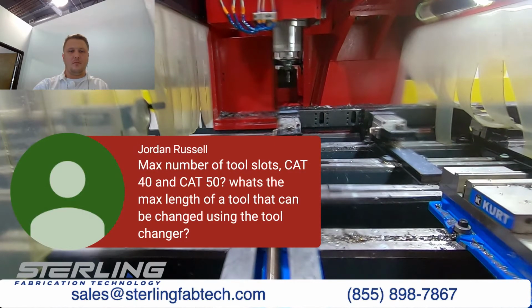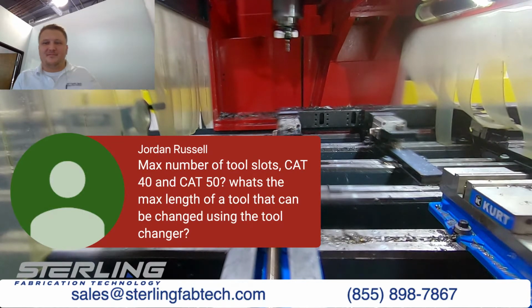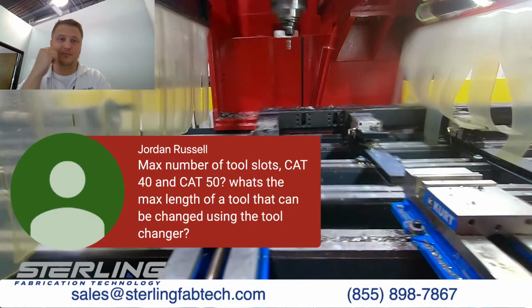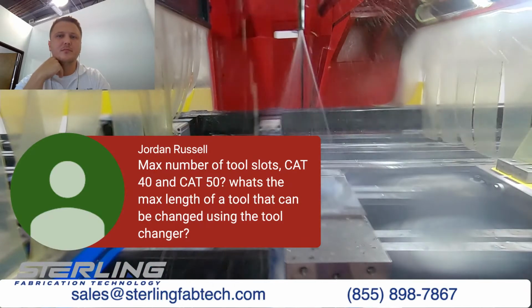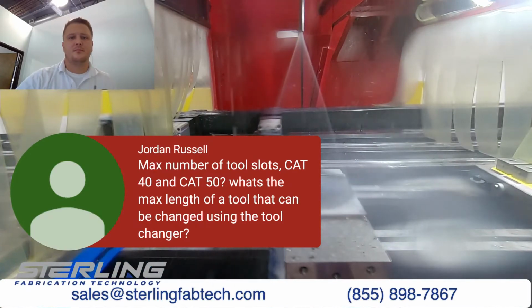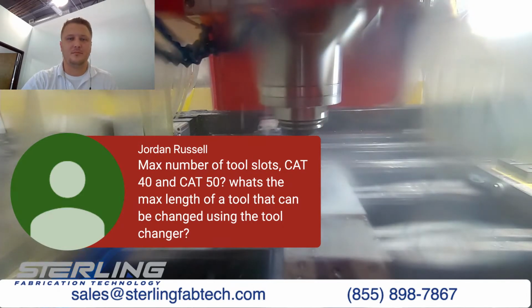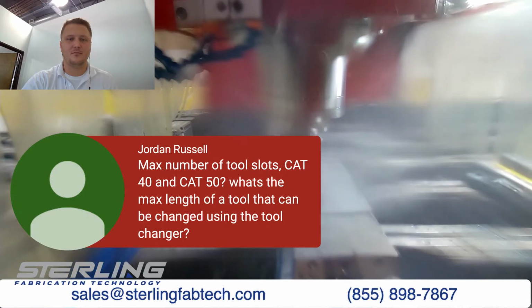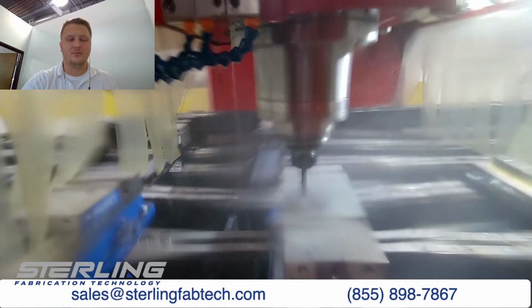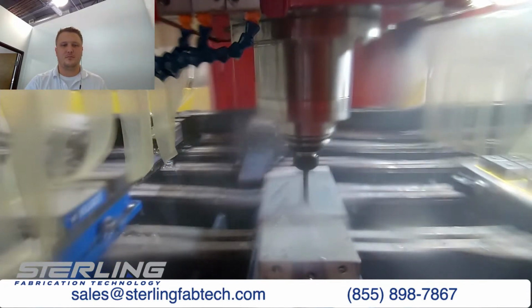Looks like our good friend Jordan Russell has a question. So max number of tool slots, Cat 40 and Cat 50, and then what's the max length of a tool that can be changed using the tool changer? So let's start off here, Aaron. We got the max number of tool slots for our Cat 40 spindle as well as our Cat 50. We're looking at 24 tools available on the G series, and then 20 as well on the Cat 50. Is that correct? Absolutely. So we got 24 of the Cat 40, and then we got the 20 on the Cat 50.